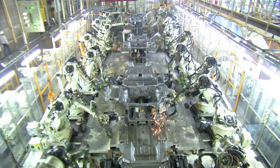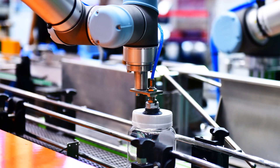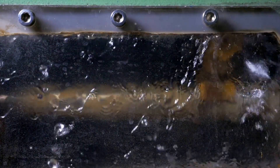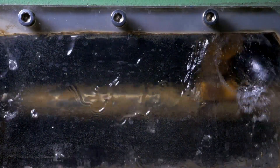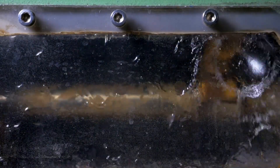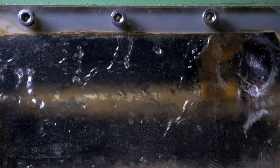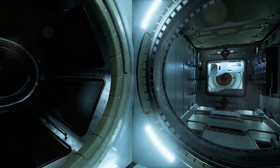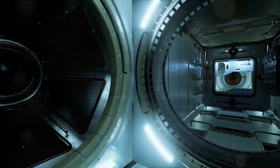The next step in the process is the key to insulation: the vacuum creation. It's like magic, but with a scientific twist. The air is sucked out from the gap between the two layers of stainless steel — imagine it as an invisible barrier, a force field, that stands between the hot or cold beverage inside and the temperature outside. In essence, a vacuum is a space utterly devoid of matter, especially air — a tiny space in your water bottle, completely empty, acting as a barrier against heat transfer.